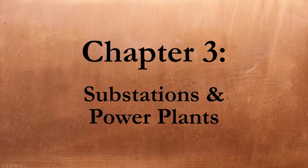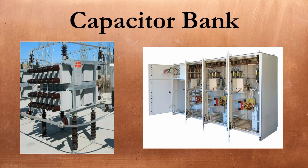Chapter three: substation equipment and power plants. Cap banks are an interesting component you'll find in medium-voltage substations, utilities, solar farms, or wind farms. They can be enclosed in switchgear or be freestanding outdoors. Very simply, they're big, giant, high-capacity capacitors that tweak the power factor so that the load can run more efficiently, or so that the power generation site can sell their power to the grid at a higher price for being within the quality tolerance that the grid operator wants.